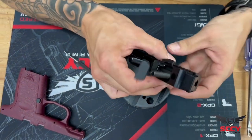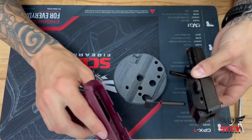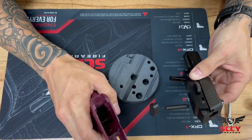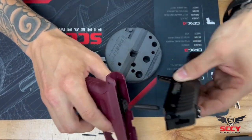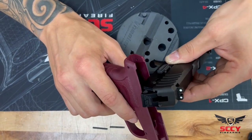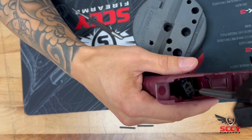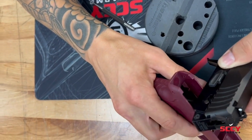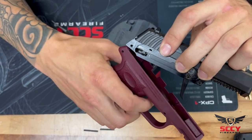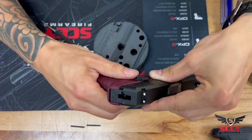Pinching that area, I'm going to take the butt cap of the hammer spring and lower it into the mag pocket of the grip module. I usually like to keep the frame and slide assembly at a sideways angle until I get it into the grip — if you go straight in it kind of hits a little bit, so it makes it easier to get it down in there and then twist. Next, I'm going to align my trigger with the trigger hole inside of the grip, placing that inside and just lowering it in very nice and easy.